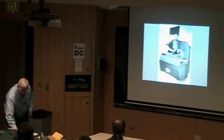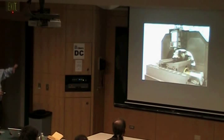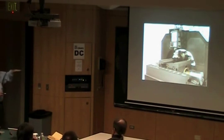The measurements were made with a little direct contact, a little tiny ball, initially ruby, later something else, that would rest on the work. And it was positioned by a servo that made it contact with constant pressure. And we could move the work with constant speed and draw that profile very fast, and could make as many profiles as we wanted to do a three-dimensional job.